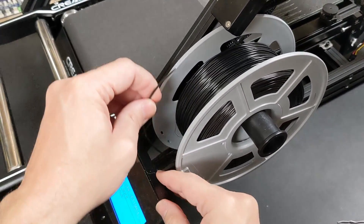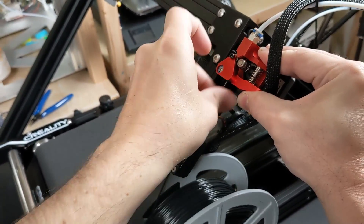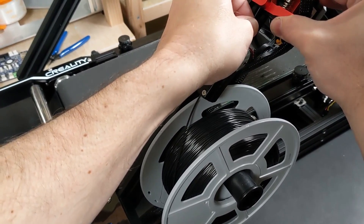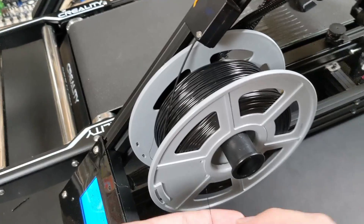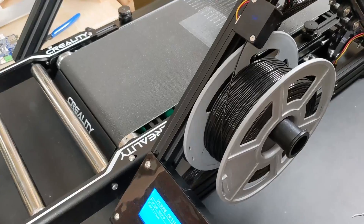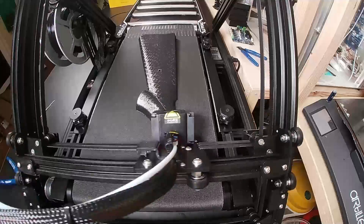This cheap filament — I have to dry it like crazy even though it's PLA. I think it's got HIPS — high impact polystyrene — which is even less expensive than PLA. I think they've doped the filament with HIPS, which means it soaks up moisture from the atmosphere really badly. I'm constantly having to dry it every time I do a print, like it's nylon. When it gets moisture in it, it gets super brittle and breaks before it even makes it into the extruder. You pay for what you get — buy the lowest quality filament from eBay and this is what you're going to get. I'm convinced it was the source of my nozzle jam and it's going to cause further problems later in this video.